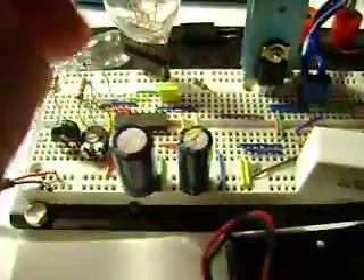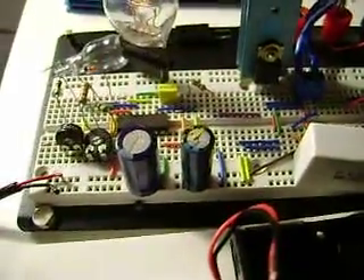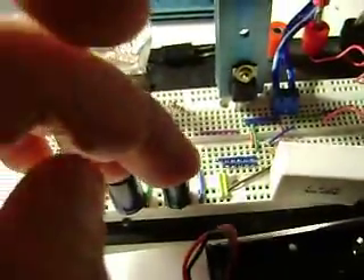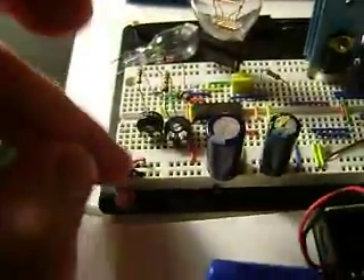I put them in places instead of LEDs for some things, and the variance gives me better ideas of what's going on visually. I got this one going off of the battery coming in. Just have these caps on here — 2,000 microfarad and 1,000 microfarad — stiffening it up a little bit. So there might be more current in the circuit than one amp, especially when it's pulsing from these, it could be quite a bit. My measuring coming from here is where I'm going to get a good idea of what it is, even though the circuit might be pulling pulses of much higher current from the caps. So the capabilities of the circuit during those pulses can be a lot greater than the limits from here.